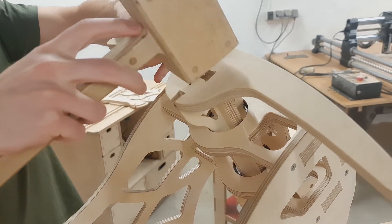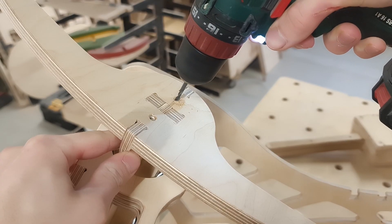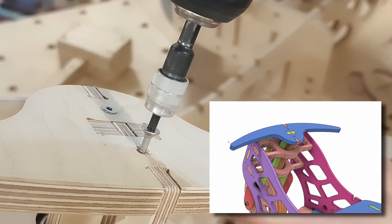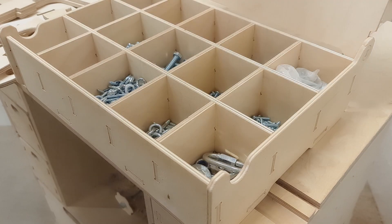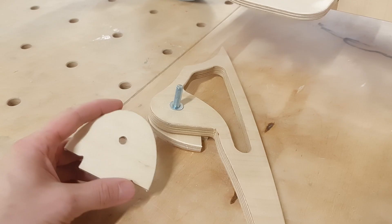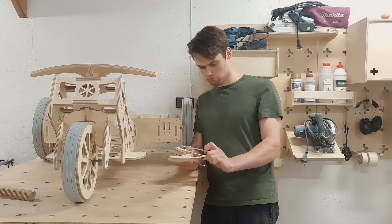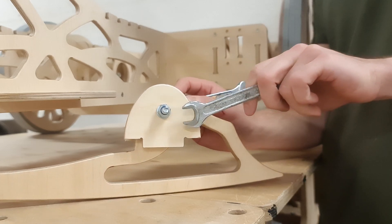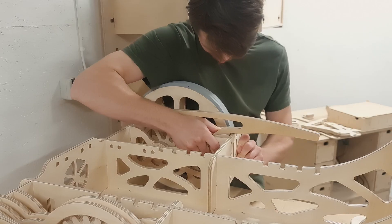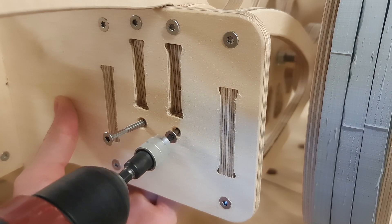Let's continue by attaching the steering wheel to the assembly. The steering wheel was one of the components that had to be redesigned a couple of times, mostly for aesthetic purposes. This time we ended up with an elongated steering wheel whose shape not only is as simple as possible, but also matches the shape of the handbrake. One of the last tasks is attaching the brakes to the go-kart frame. But before we do that, we have to assemble the brake axis — simply add a couple of washers and brake mounts on a screw with a handbrake component in the middle and attach a lock nut to secure the assembly. Considering the mount joints and the space is quite tight, installing the brakes wasn't as easy as expected. However, I soon realized I could use screws to pull the brake assembly joints into the frame component mortises, and it worked wonderfully.